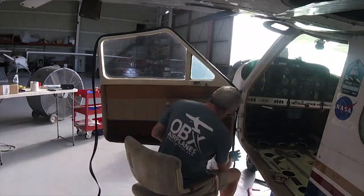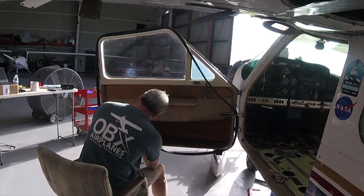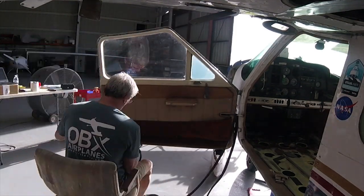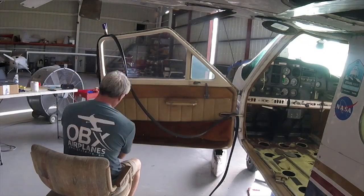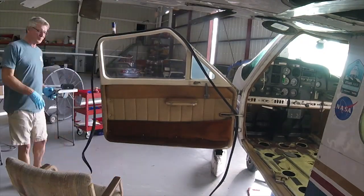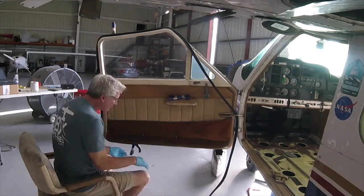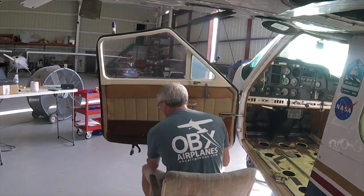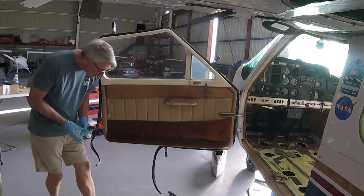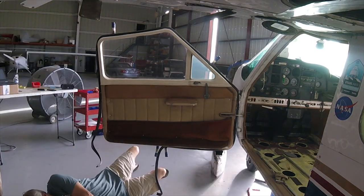So they actually went on a whole lot easier than I thought. What you wanna do first is measure the whole thing out. So lay the whole door seal over the entire circumference of the door, and you wanna make your seam all the way at the bottom. And I chose to put my seam a little bit toward the back of the bottom, just in case there was a little breeze there. It wouldn't be getting me, it would be getting somebody who's sitting in the back seat.